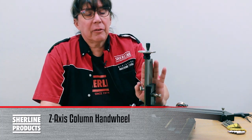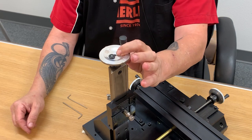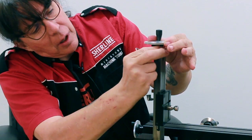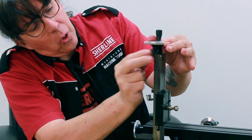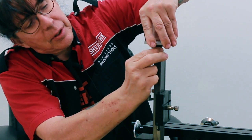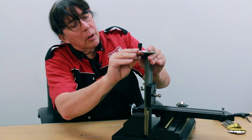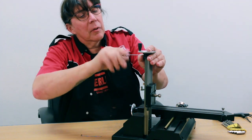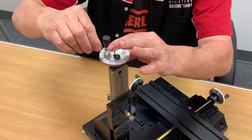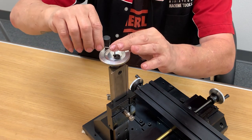Now the Z on the milling machine is slightly different in that it does have the set screw on the side, but it also has a little captive screw on top. You start off the same way — loosen the thumb wheel, find your hole in the number dial, hold the number dial and turn the silver hand wheel until you see the set screw through the hole. Put your allen wrench in and loosen it up, maybe a turn. The difference is there's a little flat head screw on top that you can't take out because it's held captive by the locking thumb wheel.